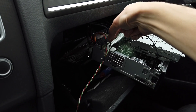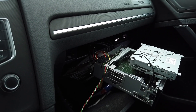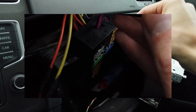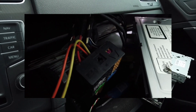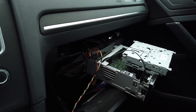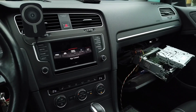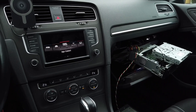When trying to plug in the connectors, you can use terminals from a radio adapter — like a Ford-to-ISO standard adapter. When you remove the quad lock connector there's a purple locking device which you need to pull out, then you can insert new pins, then place it back to make sure the connectors are in the correct place. If you have any questions about this recovery process, leave them in the comments below and I'll try to help out if I can.